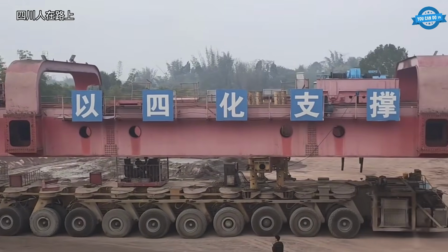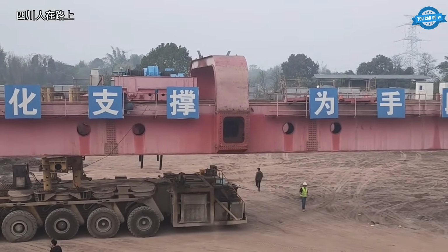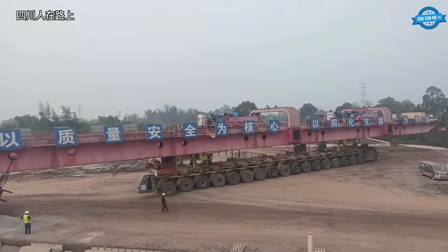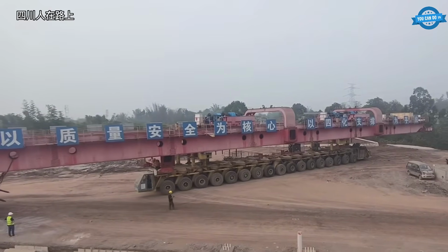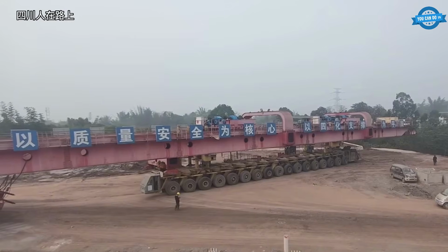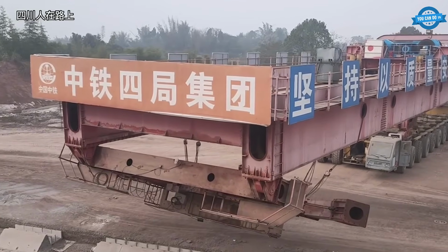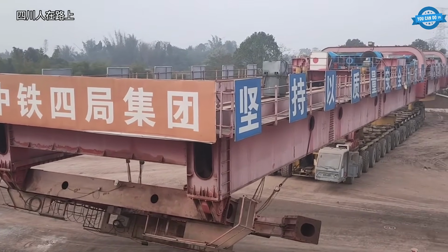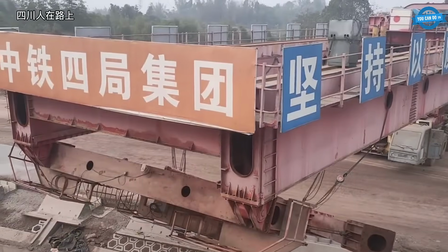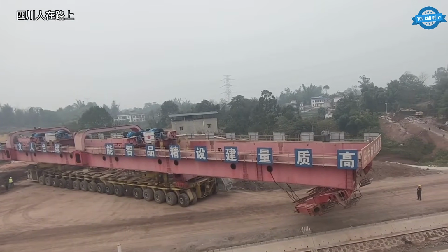Forward, back, adjust the angle. Forward, back, adjust again. 13 full round trips is not unusual for one U-turn. Total time to complete the whole turn, roughly 40 minutes. Which sounds slow until you remember this is a 570-ton machine changing direction with 0 damage to a bridge full of finished box girders. Special transition supports get added to the transporter to help move the gantry more efficiently during the swap, because otherwise the reposition would eat into the erection schedule for days.